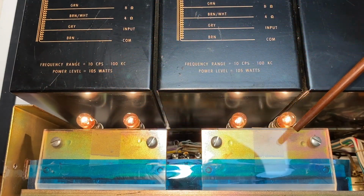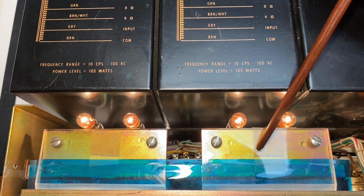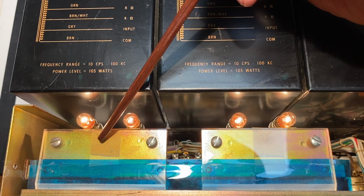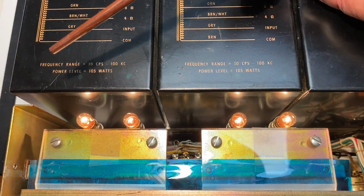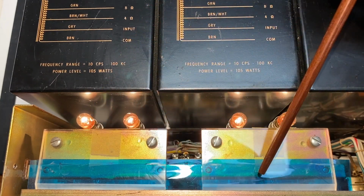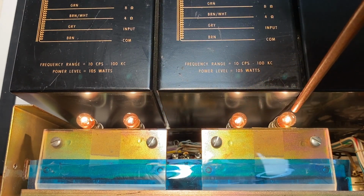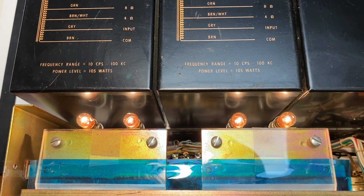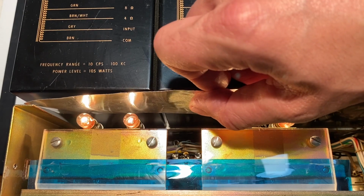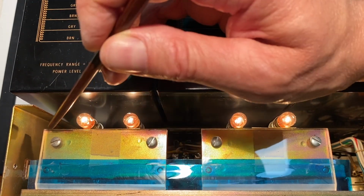These are the 4 lamps for the meters, and you can see the way this works is there's a plastic piece here and a plastic piece here, which catches the light and channels it down into the meters. And also there's this sort of aqua film that McIntosh uses to create that nice blue glow. And this is the area behind that I found benefited from having some reflective material. When I was showing you, I was basically slipping in reflective material back there like that. And that was enough to redirect it back into this plastic piece here. So I think it's worth doing.